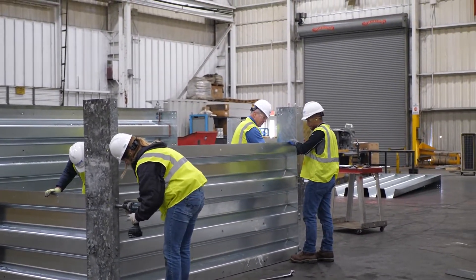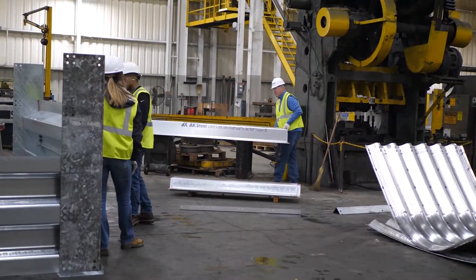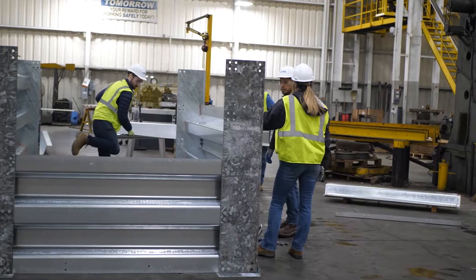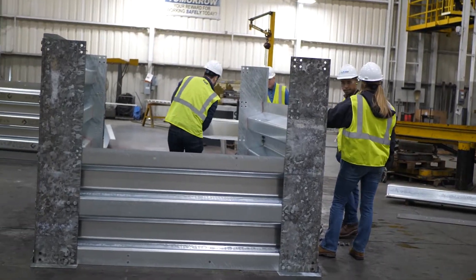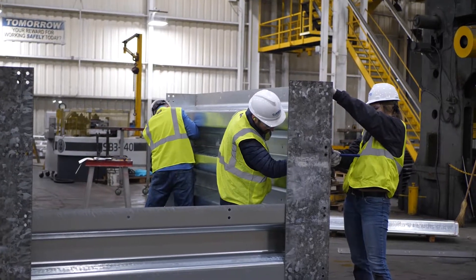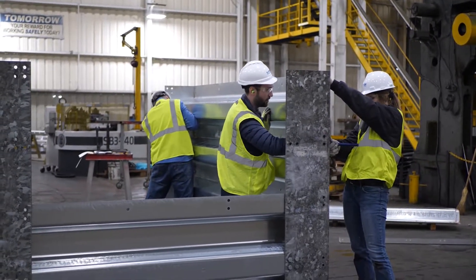We are just attaching more stringers and spacers. Note there are intermediate holes where stringers and spacers overlap. You need to bolt these components together at all locations except one of the holes of the double hole set on the spacers.